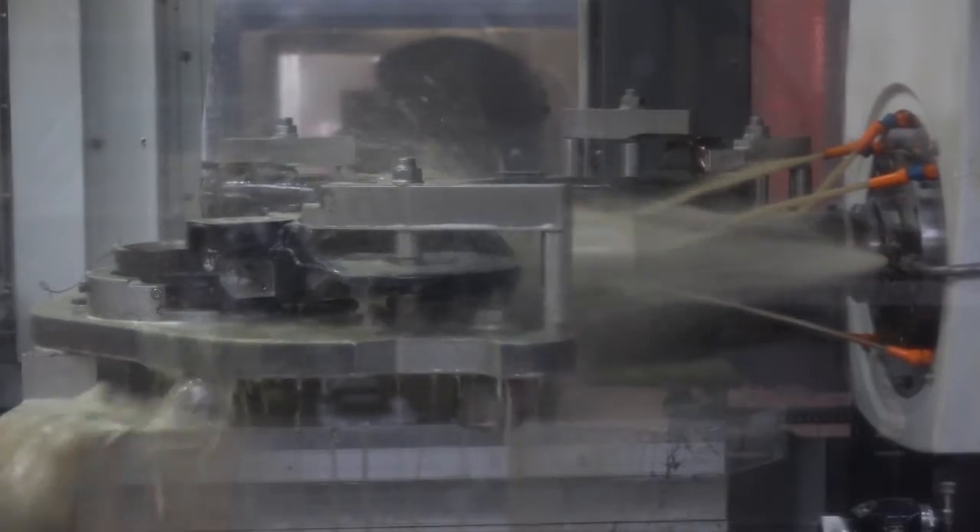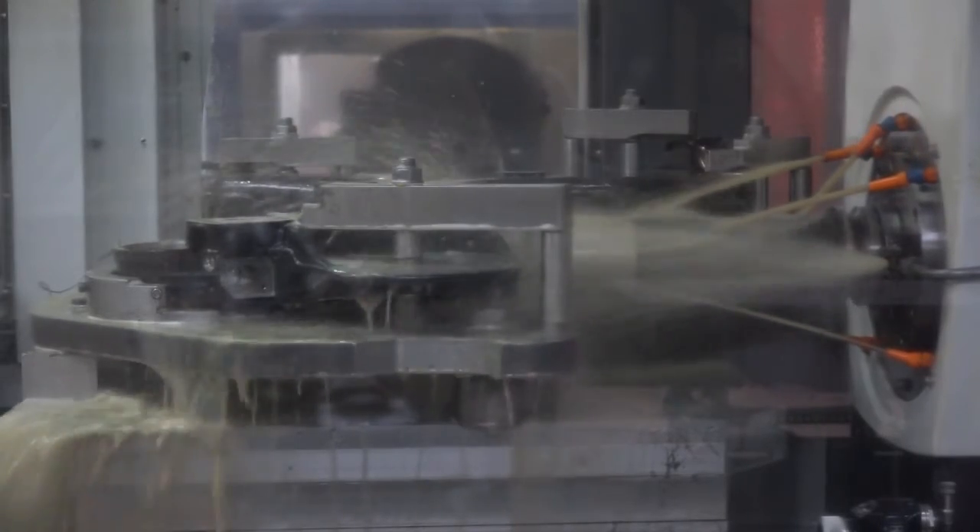You're achieving some pretty tight tolerances, I believe. Yeah, there are bearing bores on these on different horizontal and vertical axes. To get it all done in the same setup, it also holds a probe for us to check all the sizes and things on it, which is fantastic. With other machines, if you load in between operations, you're not getting the accuracy. Here we are getting the accuracy — top plane, bottom plane, all the same.